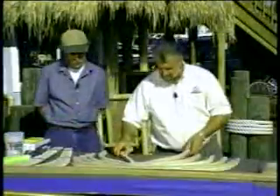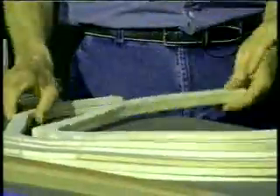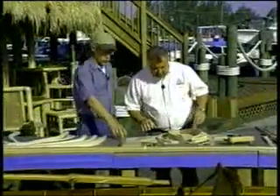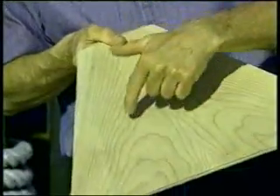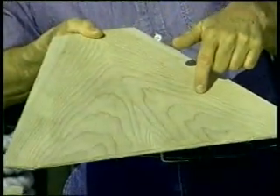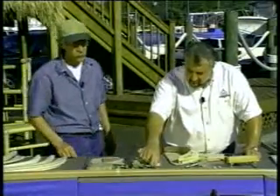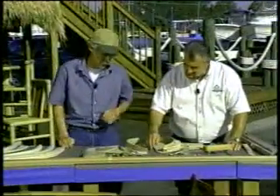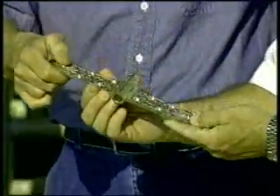What are the stem and ribs made out of? They're made out of northern spruce, and they've been first steam-bent into a form to assume this shape all the way across from gunnel to gunnel. And what are we looking at here? These are some of the parts to the deck — the guide boat has a deck forward and aft. This is cherry wood, and you can see that it's actually bookmatched; we use the same grain from one side to the other. Cherry wood's a beautiful wood, and that's why we love to use it — it's a very high-quality kit. This hardware is a bronze alloy, and it's a traditional Adirondack guide boat pattern as was used about 150 years ago.